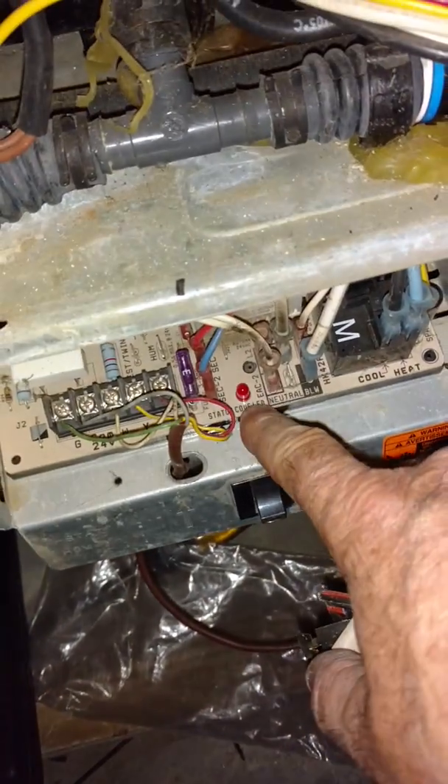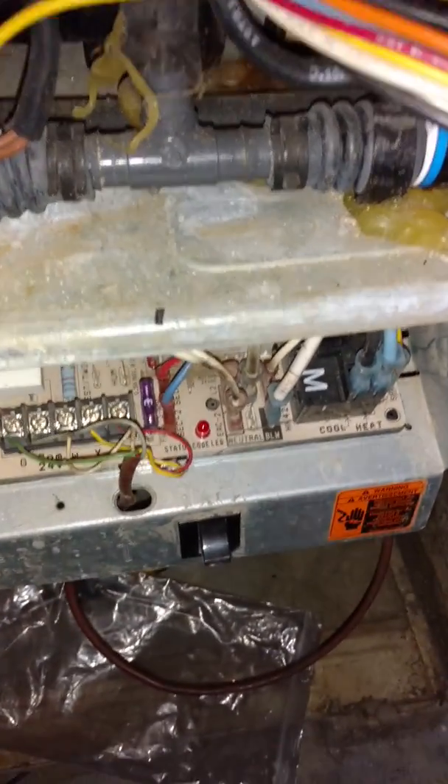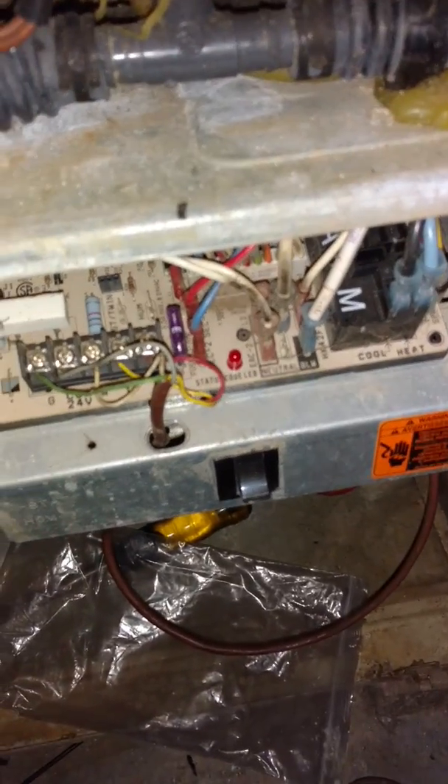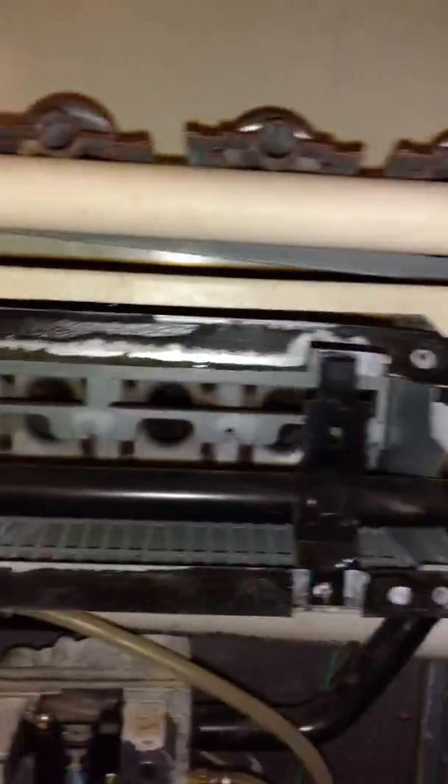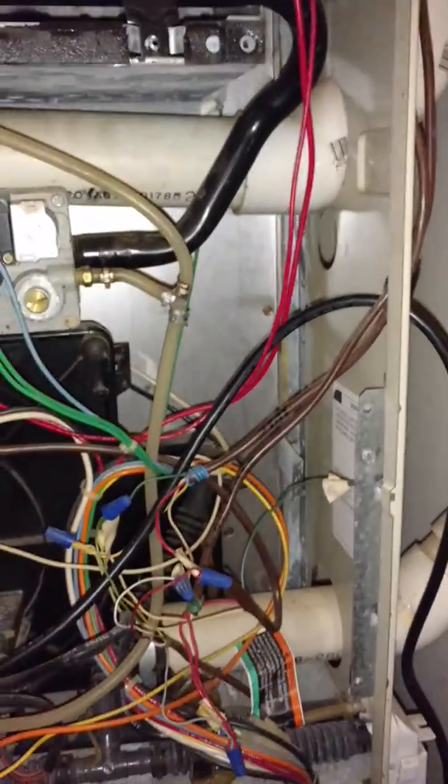You only need to get back here first and look — if you don't see any orange, if the problem is no orange flame, then you get your code of three short beeps of red on this LED and four long beeps of LED. That code, if you look it up in the manual, means something like 'no proof of flame.' It cannot be proven that there is a flame, so the logic board said therefore we're shutting down. I think it does it several times before it shuts down for good, and then you have to cycle the power off and back on again to get it to think it's brand new again.